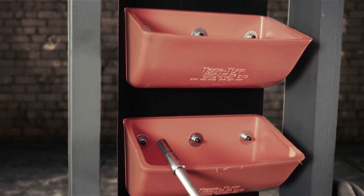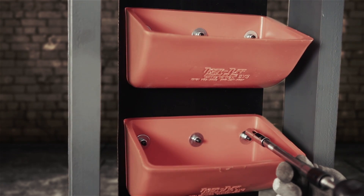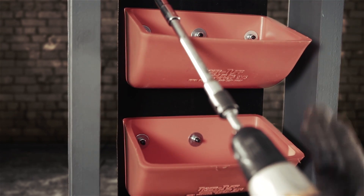You've got to make sure your bolts are tightened correctly. When I tighten bucket bolts, I like to start from the left to the right. When you move to the next bucket, I like to start from the right to the left — I like to stagger. That'll keep any kind of bow out of your belt.